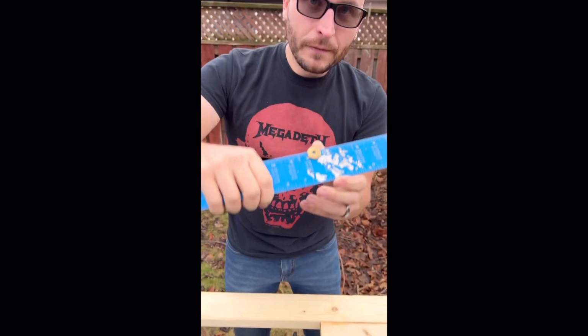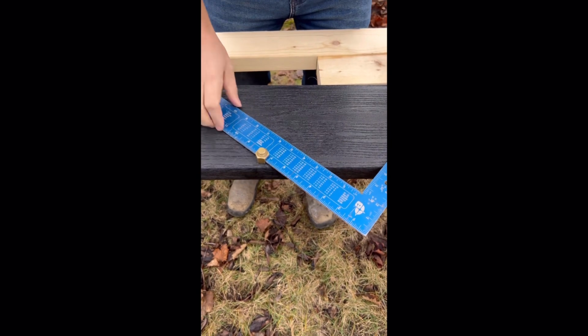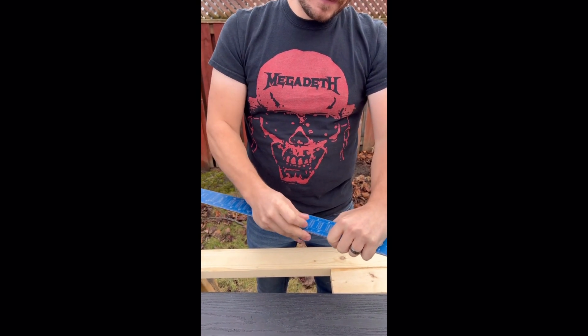The issue is, you've got a very small amount of surface to actually catch the wood. And with pressure treated lumber, it's all over the place. So one of the biggest issues is you get this kind of slipping and sliding. So what these guys have done, they've invented the most obvious in hindsight invention ever, which are always the best ones, where they just made a regular stair gauge bigger. So now you put it on your framing square and look at that.